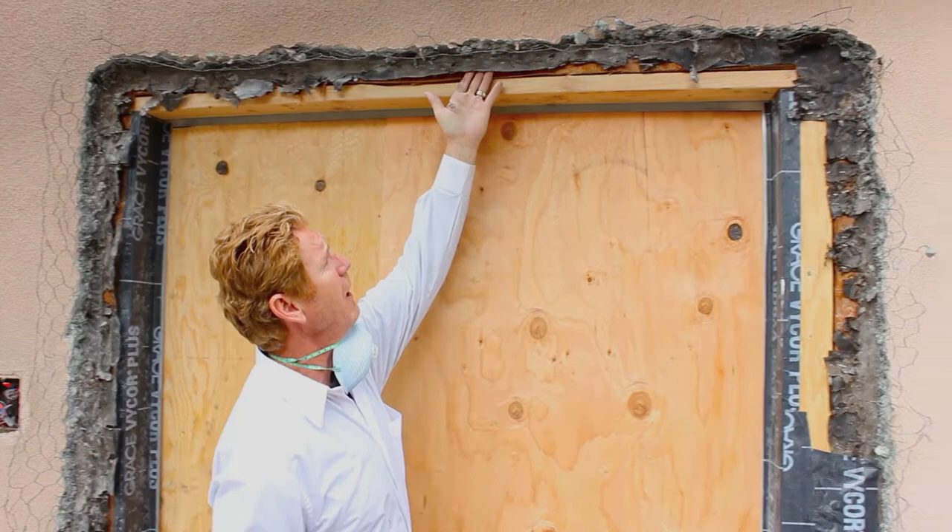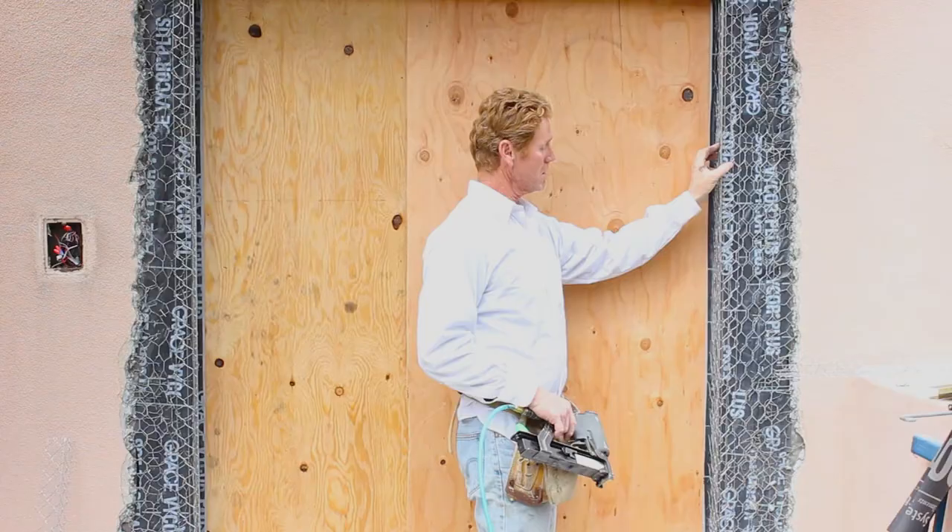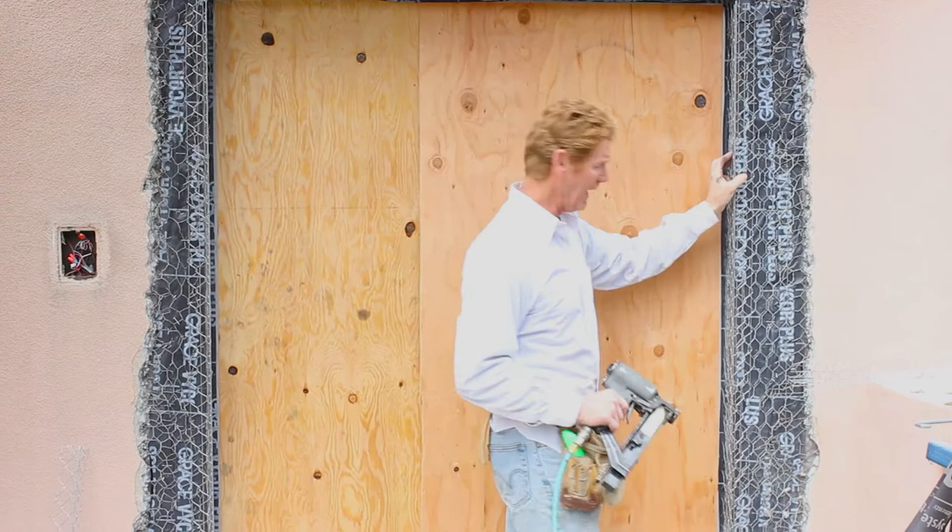The other critical thing is the tops. Now we've removed all of this — you see how this paper flaps up? We're going to put the membrane here, bend this corner, all the way here. Then we're going to go underneath this membrane all the way around. Once we're all the way around, we're going to go ahead and wire it up. That's the easy part — then the stucco.